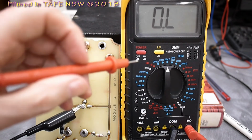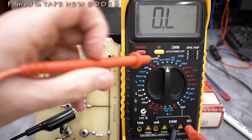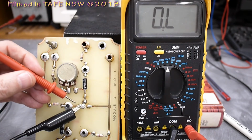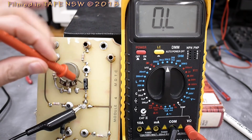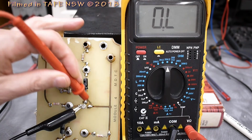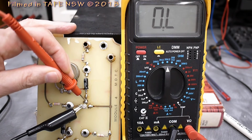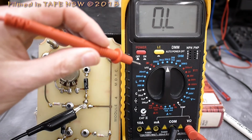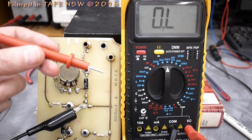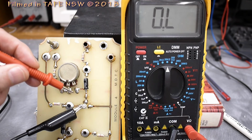In this scene, I have the digital multimeter set up on the resistance range, and then I put the negative lead to the collector, and we'll put the positive lead to the base. Ooh, we know it's an NPN, but we don't get any deflection. Why not? Well, the fact is that this type of meter has an entirely different electronic circuit with virtually no current in the leads, so we don't get enough current to forward bias the transistor.